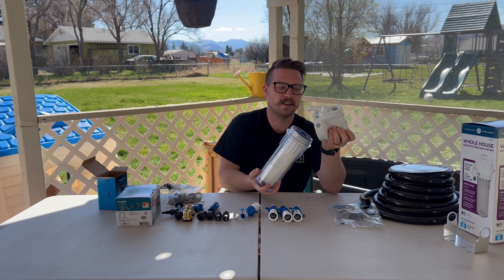The water is at 52 degrees right now — straight out of my well. It's been a week now and everything's working good. I've got the water temp down as low as 35 degrees. It gets down to 35 when I set it, no problem. As you can tell it's very quiet — even with the lid open, with the pump and chiller running, you can barely hear it. I did end up with a couple of leaks after that first night — right around the bulkhead, just barely a drip every couple minutes. I drained the tank a little and put some Flex Seal adhesive around there. I also had a very slight leak around one of the hose connections — sprayed some Flex Seal spray around it and it sealed up just fine.